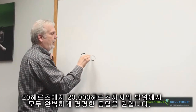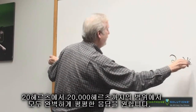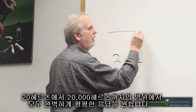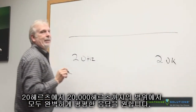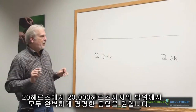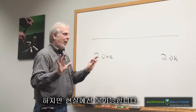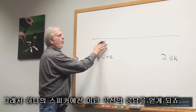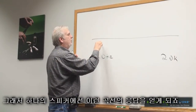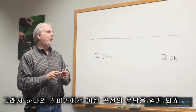I'm going to draw 20 hertz up to 20k. The ideal thing in the world is to have a frequency response that's perfectly flat — at least that's what everybody aspires to in the measurement booth. In the real world, as soon as you put that speaker system in your living room, there's going to be some changes. With a single speaker, we may have a performance that's a little bit more uneven because we're using a single speaker.